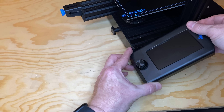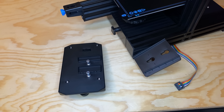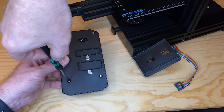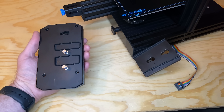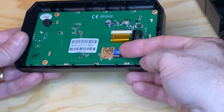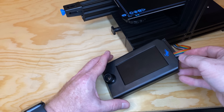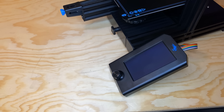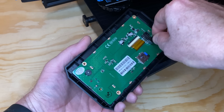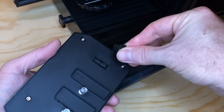Eject the card and head back to the printer. Make sure it's off, then unsnap the screen from its bracket and unplug the ribbon cable. Now we need to open up the screen's case, so remove the screws from the back, then remove the back of the screen. There's a microSD card slot inside. Plug the card into it contact side down, then plug the ribbon cable back into the screen. Turn the printer on, and the screen should update itself from the card. The screen should be blue and then change to orange when the update is complete. Once it's done, turn the printer off, remove the card from the back of the screen, and unplug the ribbon cable. Replace the back of the screen, plug the ribbon cable back in, and snap the screen back into its bracket.